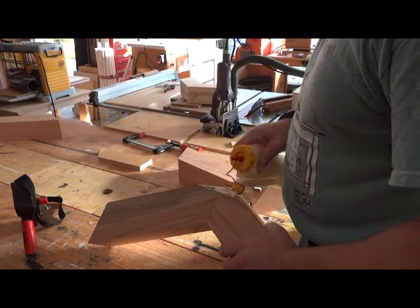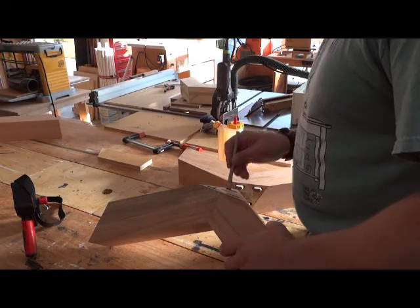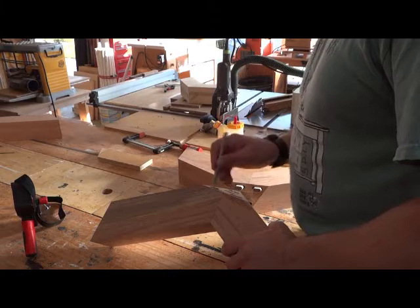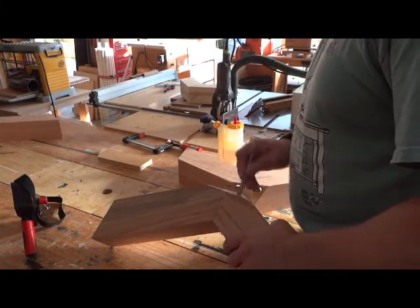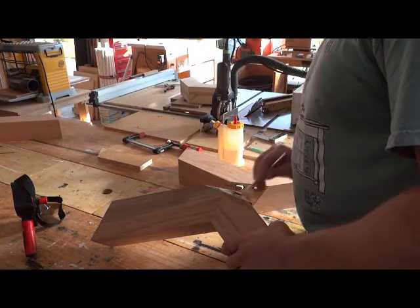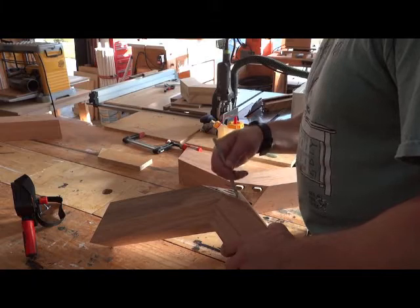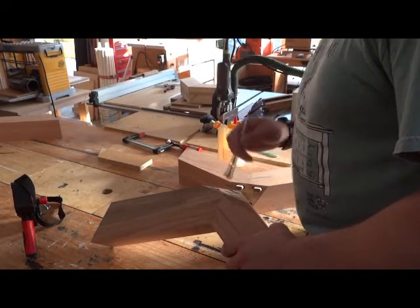So apparently I didn't film putting the third one in. You can see the domino standing up in the back there. I used that vertical plate as a reference. There's a little notch in it, and I used that to reference off the same glue line and reference off the same sort of top face there, so that I wouldn't get any offset issues coming from a different face.